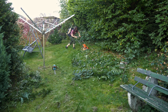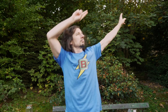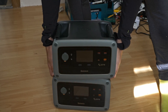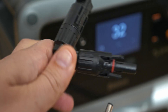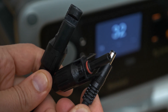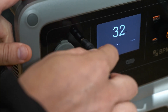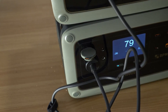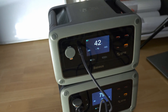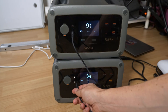Battery-powered tools are so expensive, so this is a good alternative. Since I'm battery man now doing all those reviews, I checked out the other features and found some really funky ones. First of all, since I love solar, I wanted to test the DC-in jack with the built-in MPPT controller. It can be used to charge the battery from the car or even from the car plug of the other battery. However, it does not work with the barrel jack output of the other battery — which is really strange, I thought it was internally wired to the same source.